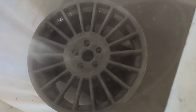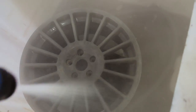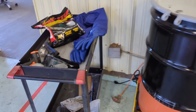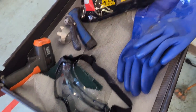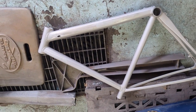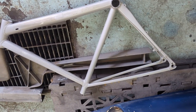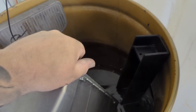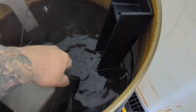Polished or brushed surfaces are not affected by EcoStrip. So if you have a candy finish over a polished or brushed aluminum, you can strip it and keep that finish. With methylene chloride-based strippers, that typically will etch the surface and get rid of your polished or brushed finish. Another cool thing is that as this product starts to break down, there is a booster additive you can order from PowderStrip to make it extra effective all over again — that'll save you from having to order a full new batch of product earlier than necessary.